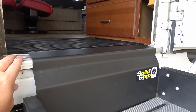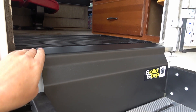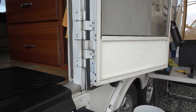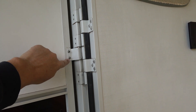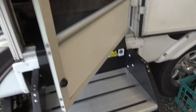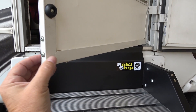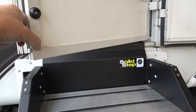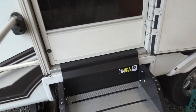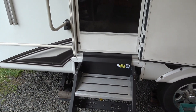Something to keep in mind if you're going to be ordering one of these - check your clearance. You might be able to remove the threshold and put some kind of flat piece of metal underneath to gain some clearance. Another option is you may be able to move the screen door up a bit - mine is a challenger door with two screws, so you could drill pilot holes and move them, maybe gain a little clearance if you have enough room at the top. You might also be able to take apart the bottom of the step and trim just a small amount off if that's all you need.